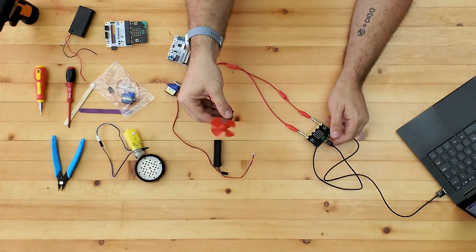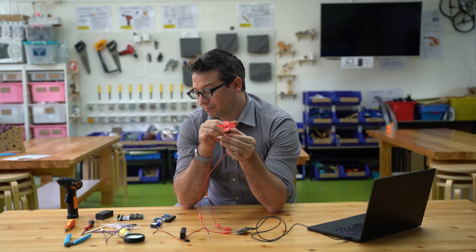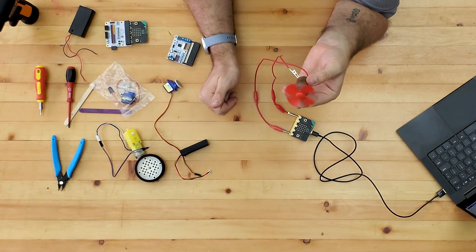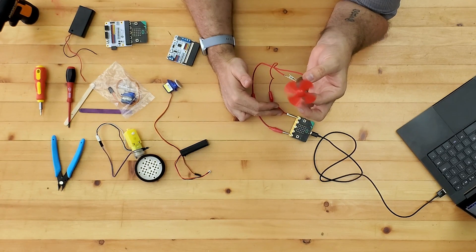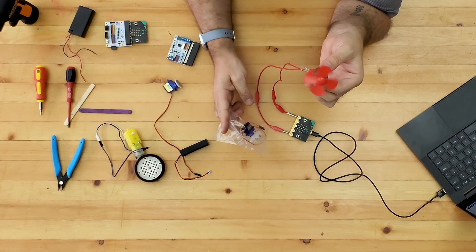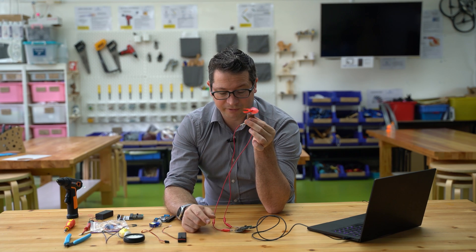Press button A and round it spins, press button B and it stops. It is pretty weak — you can hardly feel anything coming off it. The reason for this is also the problem with using some of these other motors: what comes out of the micro:bit in terms of power is good enough to light up a few LEDs and just about make this motor move, but the current is really light — about three volts, which is quite low power. To power anything more than this we'll need another way of powering it. With some servos you can just about power them off the micro:bit's built-in three volts, but it's not always reliable.